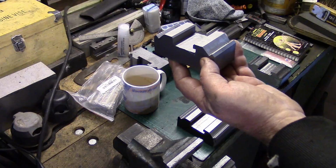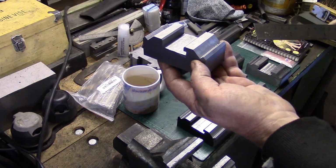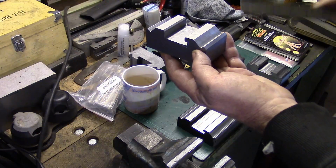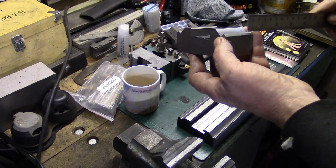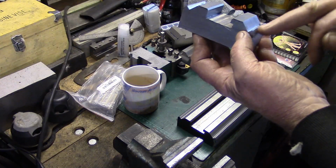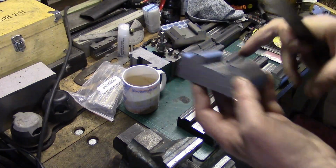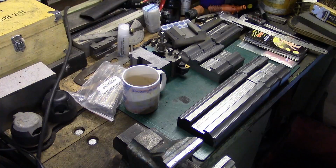Now, the one that's in the bandsaw now, when it was in the milling machine and it was milling away with the power feed on, I took my eye off it. I don't know whether it had pulled the quill down or pulled the tool down out of the collet, because instead of milling down to 250 thou, it must have gone down to nearly half an inch before I spotted it. Fortunately, on this edge, this is just a decorative thing, it doesn't really matter, and it hasn't done that much damage. I'll show you when I get them bits anyway. But that was the other bit that I had, shall we say, ballsed up. But anyway, we'll get there.